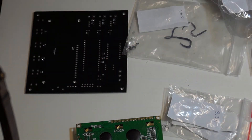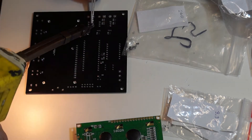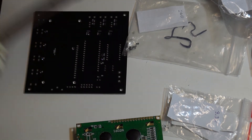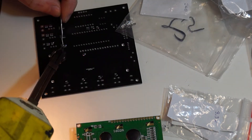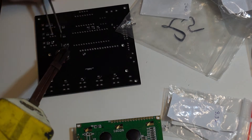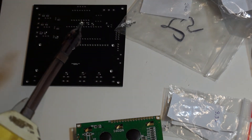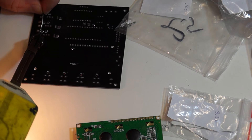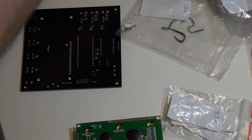When it comes to tools you will need, not much is really required. A soldering iron, preferably one with a sharp tip — but as you will see in this video, you can successfully solder SMD resistors even with a transformer iron that is older than me, and perhaps even older than you. You will also need tin, tweezers, and a collection of random objects to keep the PCB in place. Tools like a third hand, vice, and others could be useful, but they aren't really needed.